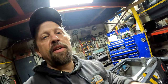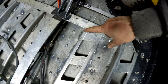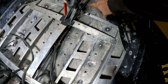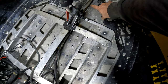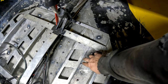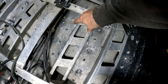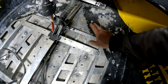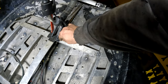The third part I'd change is up in the front. These stringers are great, they work great, but they stop short. Right in here is where I took the majority of my hit. The crack was from about here all the way up to the tip of where the floorboard rest is. What would I change here? See the way the delta pad stringers come in? I would put another one here, and I would put another one there to help hold some of that from caving in. There's a pretty good groove there on either side of that keel strip, in between that and the stringer.